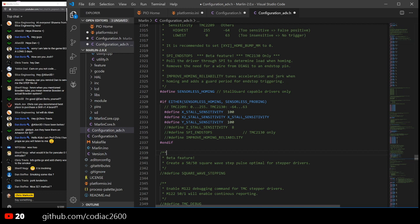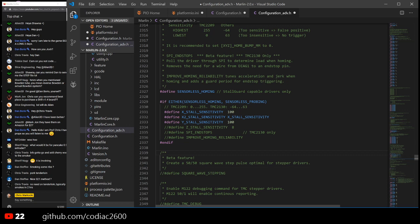So I highly recommend when you first get your printer turned on, you'll head over to motion and you'll head over to each axis and make sure each axis moves in the proper direction. After you know that each direction moves correctly, you will home each axis individually. So with the X axis, you will go to motion and then home X. It'll either move all the way to the end and stop, like it should, or it'll move all the way and stop and continue to grind.